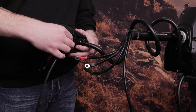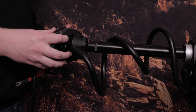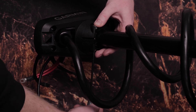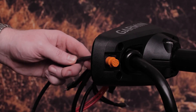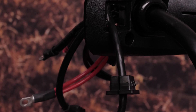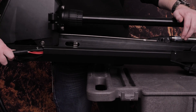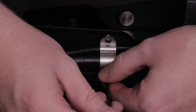Pull the cables from the shaft completely through the shaft cap. Place the shaft cap on the shaft, aligning it with the groove on the shaft. Install the quarter-20 bolt and nut to secure the shaft cap to the shaft using a four millimeter hex driver. Feed the transducer cable completely through the square hole in the shaft cap and install the grommet on the transducer cable. Route the transducer cable alongside the coiled power cable using the cable clamps to hold the cables together. Route the transducer cable through the mount base alongside the power cable, and use the cable clamps to secure the cables to the base.